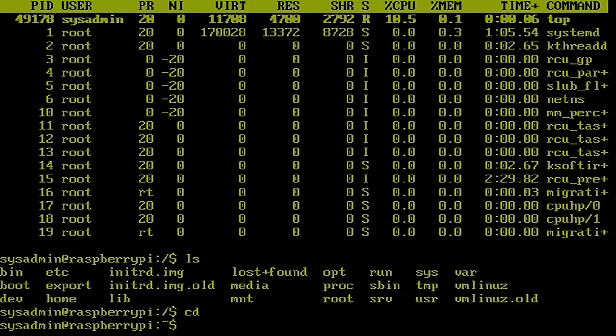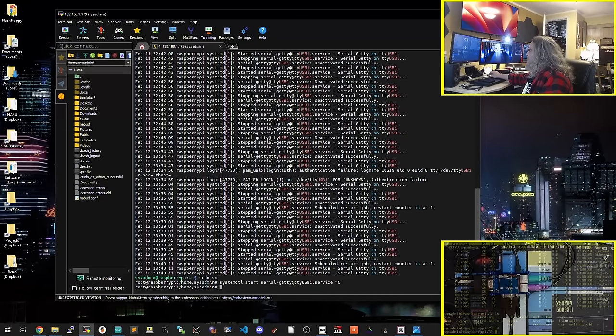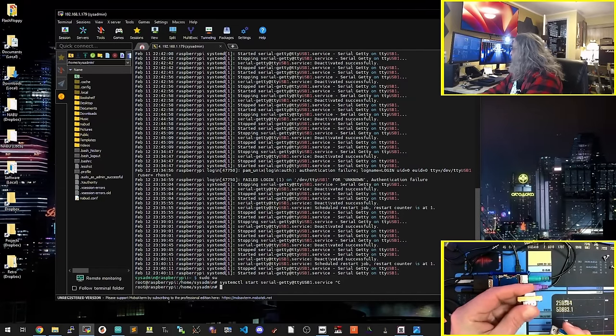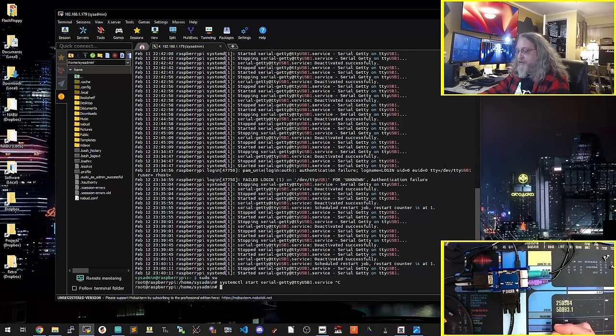So the USB cable, this is real RS-232. So in theory, with the way this is set up, I could take this and, through a series of gender changers, null modem, whatever's needed, connect it up. Get yourself an assortment: a couple of null modem adapters, some gender changers, some serial cables, which is what I'm using right here, just a straight-through DB9, just so I can get it connected. Pick those up, and you'll have some RS-232 stuff laying around.